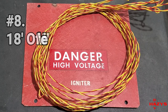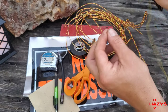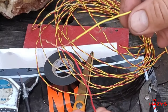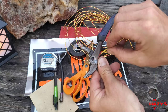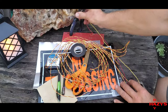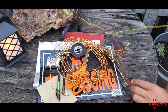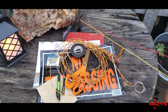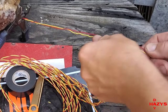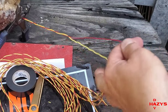Here's a quick way to braid the wires together. Strip both ends and then twist them so you have two wires started. Slide the two wires into the pair of pliers — stick the pliers in the hole so when you pull both wires to braid them together you can put some weight on it and make the braid tight. As you can see from the roll in front of you, it gets very tight. This will only take you a couple of minutes — just braid until your length of wire is complete.